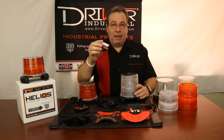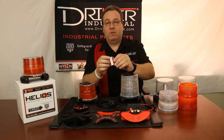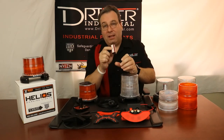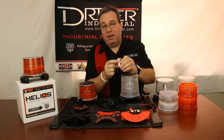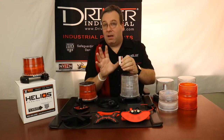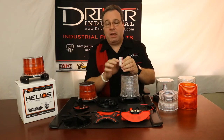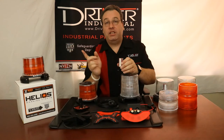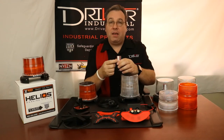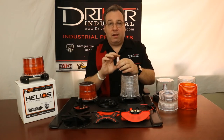This is a light emitter, and with this modularity, as you can see inside the beacon, the light emitter is where the LEDs are. There's a heat sink to dissipate the heat. We have a single LED light emitter and a dual LED light emitter. We also have coming out soon a rotating light emitter — it's not mechanical rotating, it'll be animated, with four LEDs per side, producing that rotation lighting effect. And then our last series after that is called the RGB, so we'll have an RGB color LED so you can choose any of the five colors with that one.